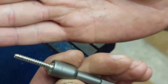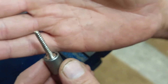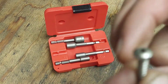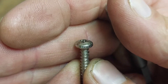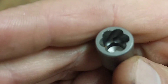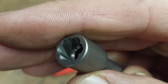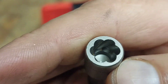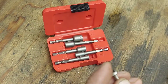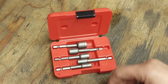That's it, guys. These look like they'll work pretty good, but they only fit certain size bolts — there are only five to choose from, so it's not going to give you a big wide variety. Here's the bolt after I pulled it out of the extractor; you can see it bit into the top of the head pretty good and left some nice little bite marks. Here's the extractor after its first use and the teeth all look good — nothing marred, bent, or torn up. These should work well for whatever you want to do around the house.